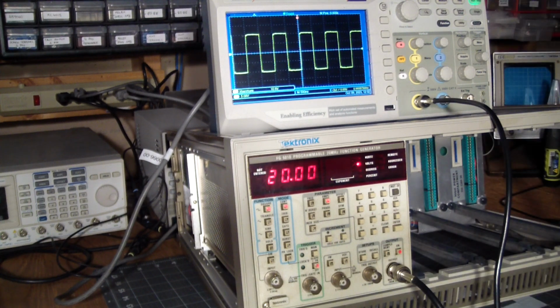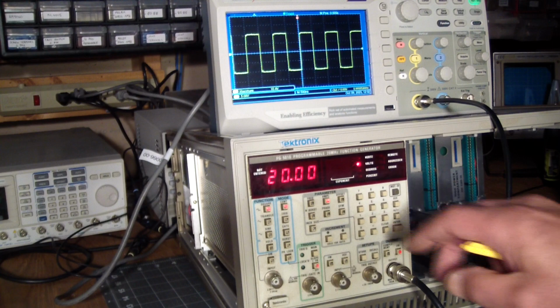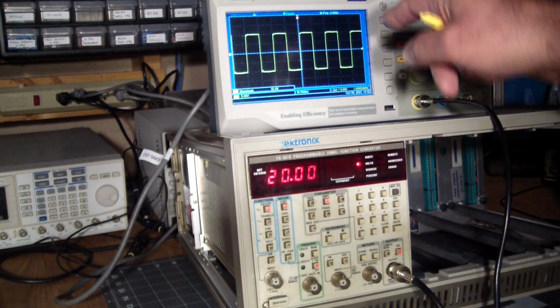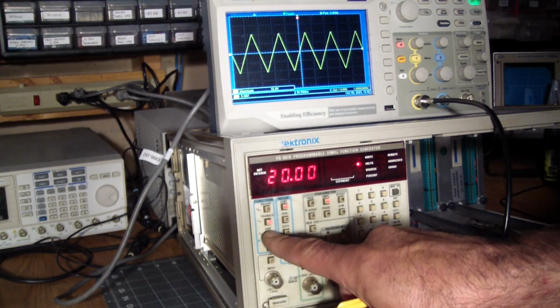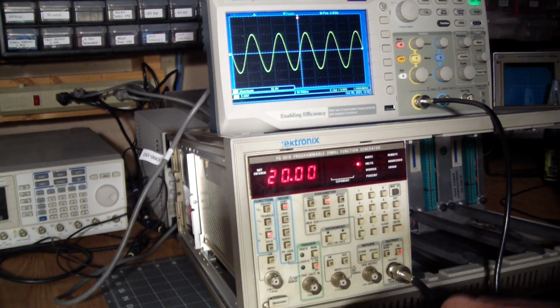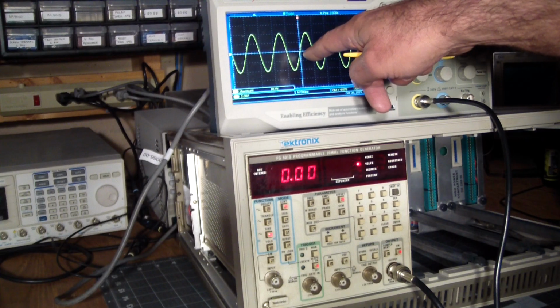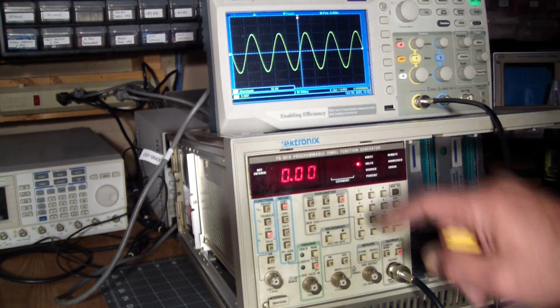And there you go. As specified, it outputs at 20 volt amplitude. Now the offset, for instance, will let us move the wave up or down, but let's see first. Is the triangle good? And the sine's good. And so as an offset, it has none now, but since we have 5 volts per division, if we give it a 5 volt offset, it should jump up 1 division.